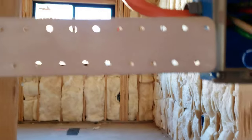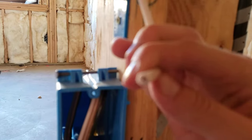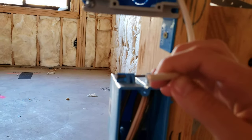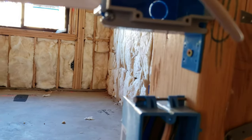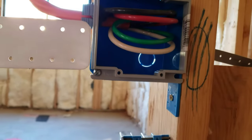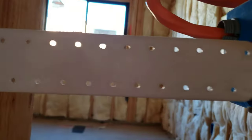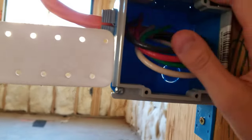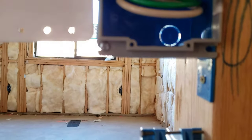In this case, this orange cable is actually copper clad aluminum and it's still a 30 amp circuit, but the cable is 8 gauge. The 8 gauge wire is only good for 30 amps of circuit, so you have to upgrade the size by one in order for it to carry the same load as copper — because with copper clad aluminum, the aluminum carries most of the load.